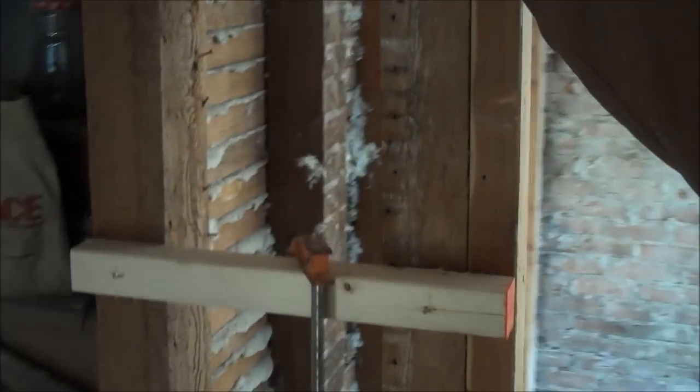Basically what we're doing is we removed an addition on the hallway that added closets to the bedrooms, because old homes didn't have closets — the British taxed them as living space, taxing by rooms. So we widened it back out and took everything down to this old rough-cut framing, which isn't exactly square. You can see we had to fur it all out for our sheetrock.